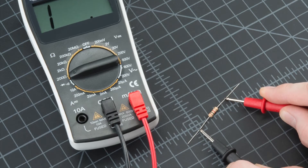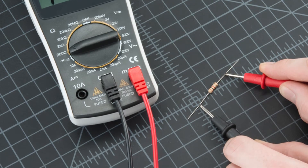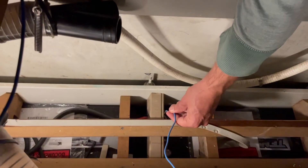We tried to measure the ohms, but our multimeter was just going into failure, so we didn't know how to interpret the results. The last check we could do was to use a light bulb. I connected the plus of the battery to the plus of the light bulb, and the minus of the light bulb to the hull — and immediately the light started to burn.